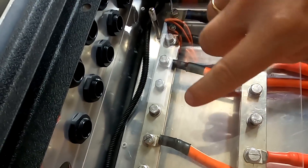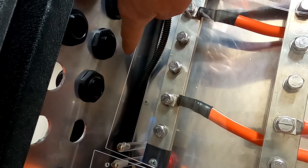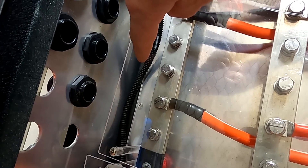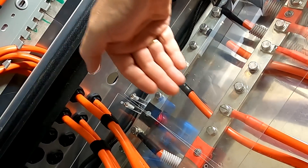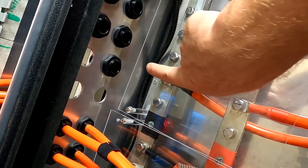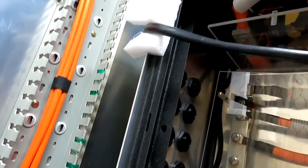I'm really going with Solution A — I'm not kidding. I want to tell you why. I made some measurements down here: if I move the glands all the way down and come through with a straight cable connecting to these bus bars, there are only 8 millimeters left between the gland and the ring terminal. I could push the cable through from the outside, crimp the ring terminal, get the heat shrink on, and then push the rest back through the gland to the outside, coming out in a bend and into the slotted duct.